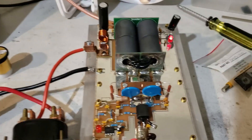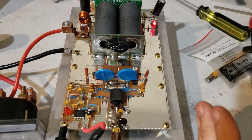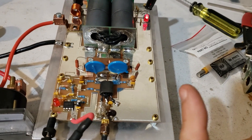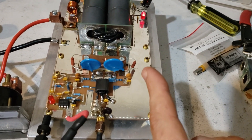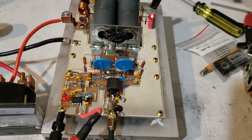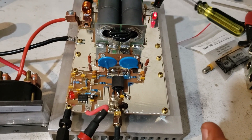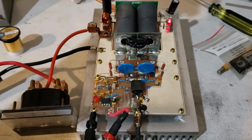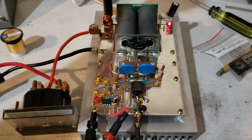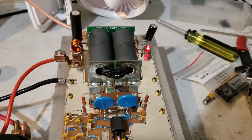The NXP pallet runs without feedback, and it runs really well without feedback — no feedback resistors, no capacitor or resistor on either side. It runs shockingly well for having no feedback. Basically I copied everything: same capacitor, same get-up as far as I could get it in the output circuit.